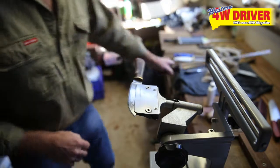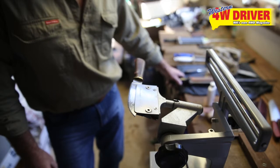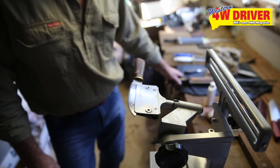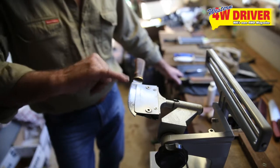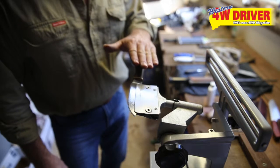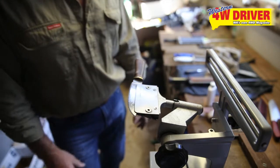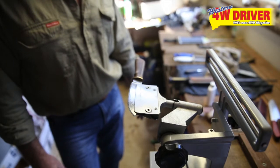So you've put the texture on the blade, along the blade, so that when you run the stone over it, you can actually tell if the angle's right and if you've got the right angle to clean that blade off according to the original angle. Set bevel, exactly. That's what we're trying to do, is make sure we've got the knife as close to the original. So once we actually start, it's not going to take too much steel off of the blade, because we don't want to falsely wear the blade, and we maintain that angle that's already on the blade. Beautiful. Let's move on.